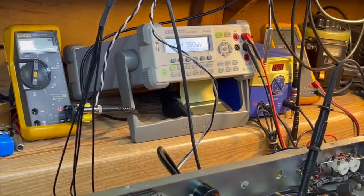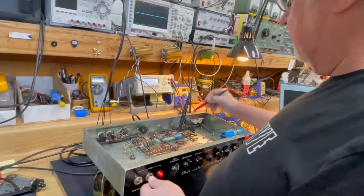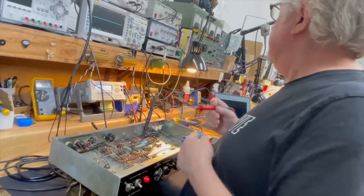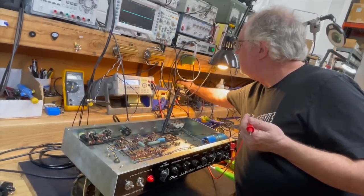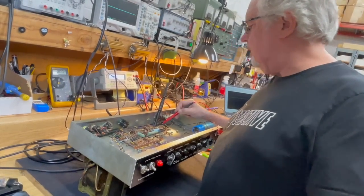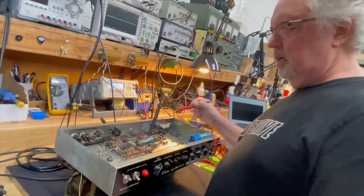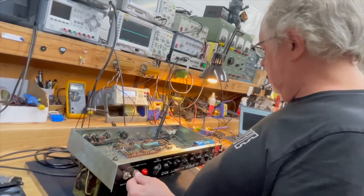Check our line voltage. Grids, we've got minus 40 volts, which is factory. That's where it's supposed to be, between 38 and 40. Depending on the line voltage, ours is right up there, so I'm going to drop it back a little bit, closer to 117 as opposed to 120. And there, we should get about 38. There we are, 39. Woohoo! And we should be ready to fly.